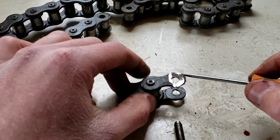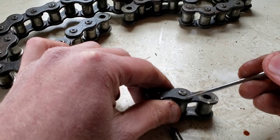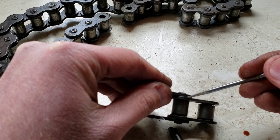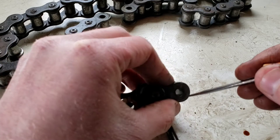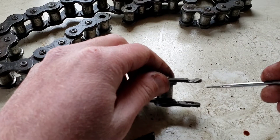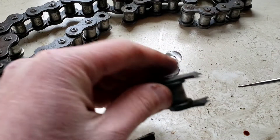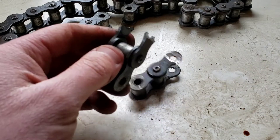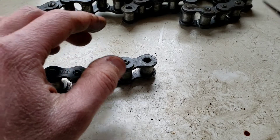When you're grinding away at this one, you also have to grind away at this top plate as well. Be careful as you get down — you don't want to start damaging any of this hole here, because then you're going to have problems when you go to put the master link back in. You can see how thin I went down here and tried not to hit that plate as much as possible. On this one I went halfway in but didn't really damage any of the links I needed — these I don't need at all, but that's just an example.